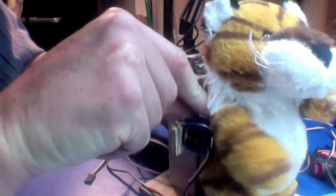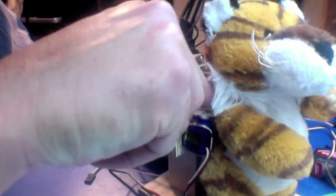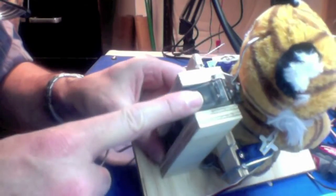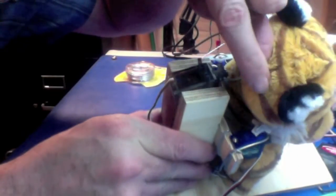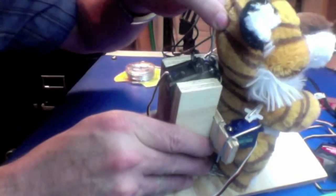There's a piece of wire that goes off the servo horn and to his arm, so when the servo moves, it moves his arm. Similarly, this servo motor up here on the top has a wire that goes to his head, and when the servo turns, that's how you get the tilting of the head.